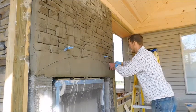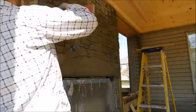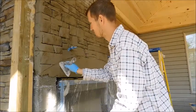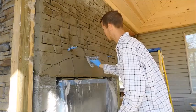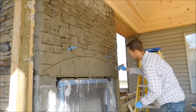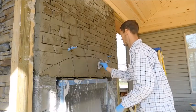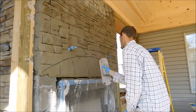Basically you'll just stamp your pattern and the stamps will do a pretty good job, but you're going to have to go back over it with your detailing tool — in my case, the plastic drywall putty knife. Because the lines between each stone, the stamp won't go very deep. And the deeper you can tuck that grout joint line in, the more realistic it's going to look and the more depth it will give to your stones.